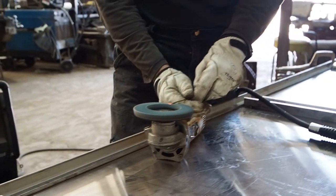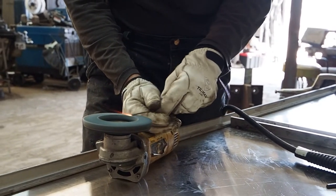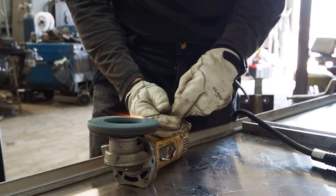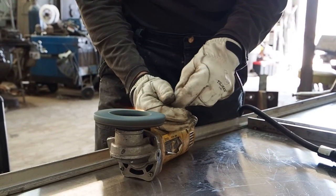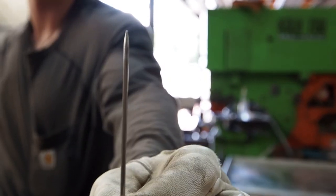Here's a massive secret of how to sharpen your electrode. It's a nice pencil point — you're going for that pencil shape. You just twirl it on a flattened angle grinder with a special pearl grinding wheel that is for aluminum and stainless. You have to keep mild steel away from stainless — you have to keep those metals separate.